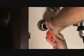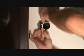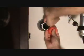You see which way I'm going? See, when I tighten the nut, this is going to be at the end over here, and it's going to have a natural tendency to want to tighten right up on there with the nut. Now, how much do you put on? Put 3 or 4 spins around there. I'm just going to kind of pull on it like that. Okay? That's the correct way to install Teflon tape.